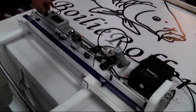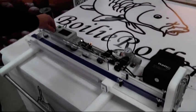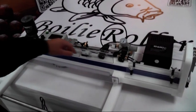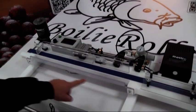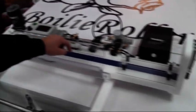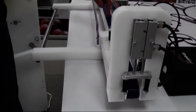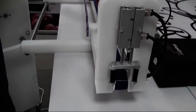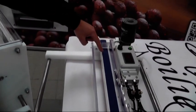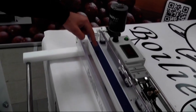If you turn on everything, the belt is turning. Here you can regulate the speed of the belt. You can also see two red spots — those are sensors. The first one is to cut the sausage. And when the sausage reaches the other sensor, it is pushed out from the belt to the machine.